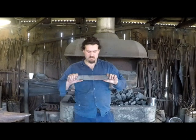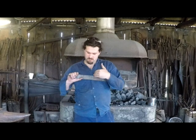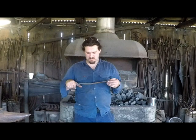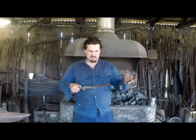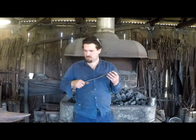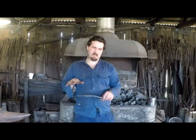Just a blacksmithing tip for this: you can use a chalk line to chalk where you're going to be, but it's a bit hard on various rasps because it's such a twisted surface. And you could put a little nick in it, but again, it's such a fractional piece, so it's a bit hard to see what you're doing with it. So to make it easier, I mark out a 3 and a 1/2 inch section of my sacrificial plate. You know, the plate of softer material you put onto your anvils when you're chiseling and stuff, so that if you go through, you're not going to damage your anvil.